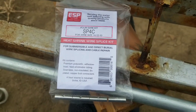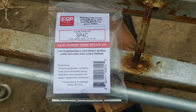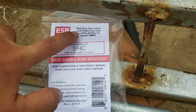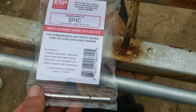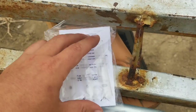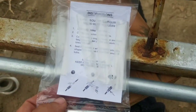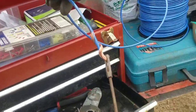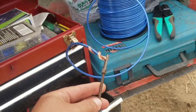For the connection from the wind turbine to the actual wires going to the conduit, we need to make sure it's really nice and waterproof. What we've picked up is a four-wire kit — completely submersible-style connectors. They have a double female on each side. You put one side of the wire on each side, crimp it, and then it has heat shrink tubing pieces which you slide around the whole thing, heat it up, it shrinks tight, and it's completely waterproof. So I'll go pull and you can feed it and take a video.